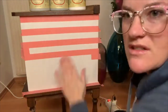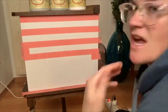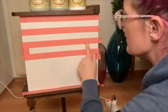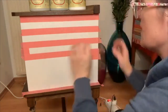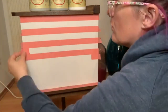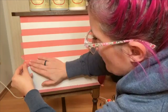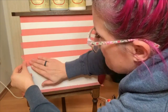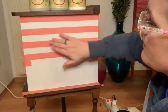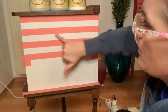This is burnishing. This is what burnishing is called. It's like if you have a transfer and you hear the word burnishing, that means keep rubbing it more. Whether you rub it with your fingers, or with transfers you can take super fine steel wool or a finishing pad to burnish it. And that helps. If you ever see people who have problems with peeling with their transfers, or problems with taping stuff off and getting paint underneath, it's because you haven't burnished those edges.